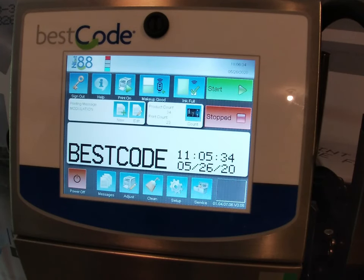One thing you have to be careful of is the model number. At the top left hand here it shows the model number of the printer. Some models are limited on the number of lines of print and also the speed — faster and fastest. For example, if you have a model 86 and you are transferring messages to a model 81, messages that were recorded or edited in the model 86 as a 3-line code would not be able to transfer to a model 81, which is only limited to 2 lines.